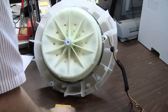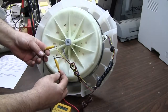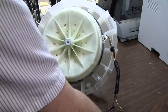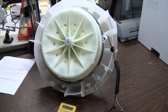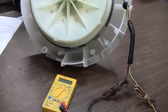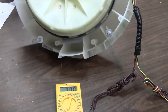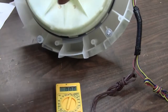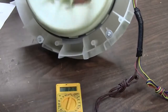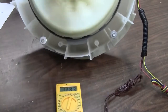With the meter connected to just two of the three legs of the three-phase alternator, I can easily demonstrate generating over 120 volts by spinning it with just one finger. I'm going to center on the meter here. And if I just spin this with one finger, I'm getting over 130 volts out of this thing.